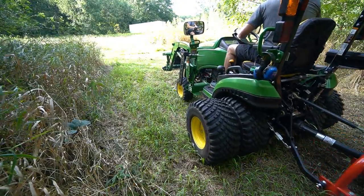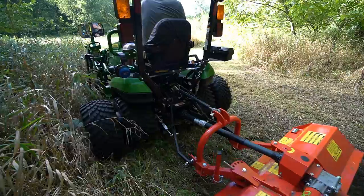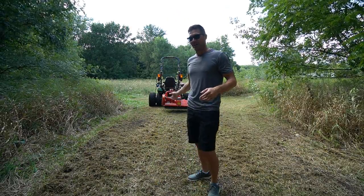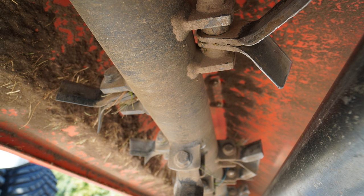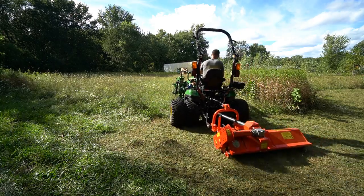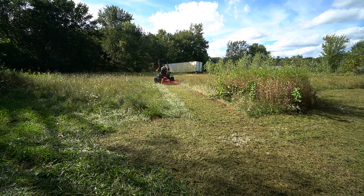You're going to see I did hit some rocks — I've got a couple rocks here. One thing that didn't even come into my brain until right now is that I'm out here without any extra shear pins or shear bolts. So I hit the first rock and thought, oh crap, I'm going to be out here stuck without a shear bolt. But then I hit the next one and realized — those flails, those teeth underneath, they kind of give. It's not like a rotary cutter or a tiller where you hit something tied solidly to a shaft. Those Y blades give, so if they hit something they just plink off and keep going around. I think that flexibility with the loose teeth that spin around naturally gives it a lot more leeway going over rocks and little stumps hidden underneath weeds and brush.